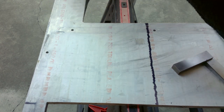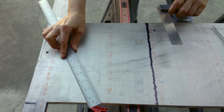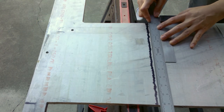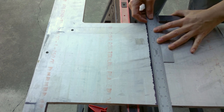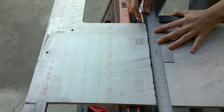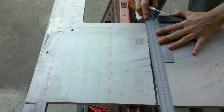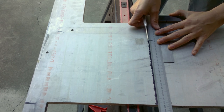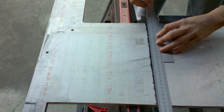Once I have my mark, I only have a short steel square to work with. But because this is a rough cut, that's not a big deal - still I want to try to make all the cuts straight and square, because maybe it will give me one more reference edge. To extend this I'm putting this steel ruler up against this - this is actually an SPI machinist ruler. Unfortunately this one was not so good and they gave me a refund on it, but for a straight edge it's fine.